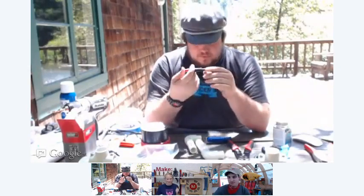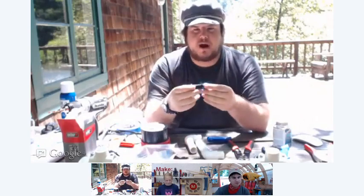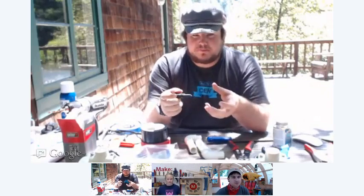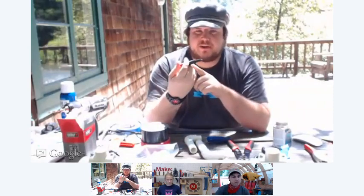So Dan, what is a piezoelectric lighter? How's it different than a spark lighter? A piezoelectric igniter uses a material that has piezoelectric properties. That means if you apply pressure to it, it will exert voltage. Okay. So quartz is what they use in this, and they use it in a lot of piezoelectric applications. When you strike it with the hammer, this little spring-loaded hammer right here, it creates a high voltage potential, which causes it to arc through the air. Gotcha. Right, so instead of having flint rubbing, you have this actual material that releases a charge.